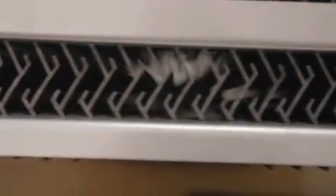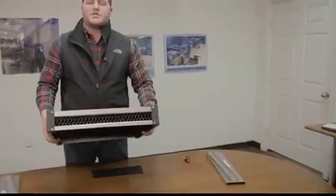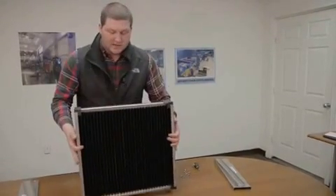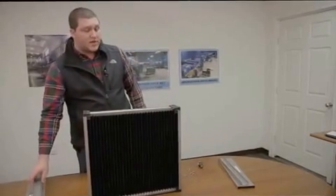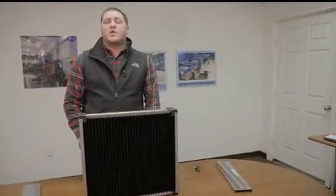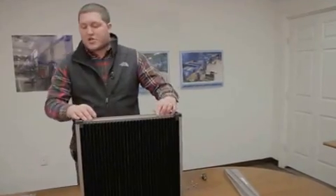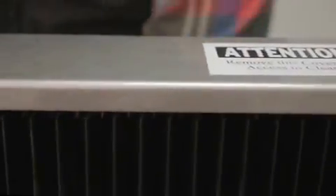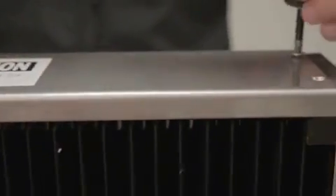Once you have taken off the top and bottom, all you need to do is move this to a pressure washing facility or outside of your building and shoot the pressure water system through it — that will clean out the impingers. You can also use a small pipe-cleaner-type stylus in order to really get in there and clean them, but a pressure washer will work 100% of the time. Once you've finished washing it, just make sure you put the covers back on, the screws back in all the way, and place it back into your unit and it will run just fine.